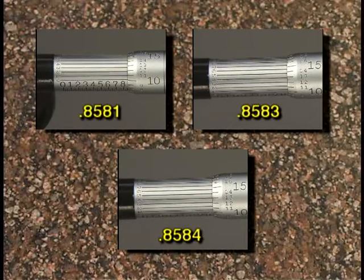Looking at our previous measurements, all of the tenths values are slightly above the nominal dimension. We can therefore conclude that this feature's actual size is probably slightly above the nominal size but within the specified tolerance.